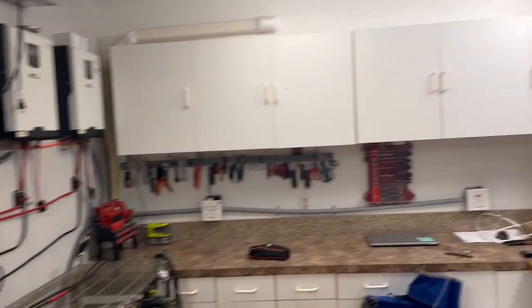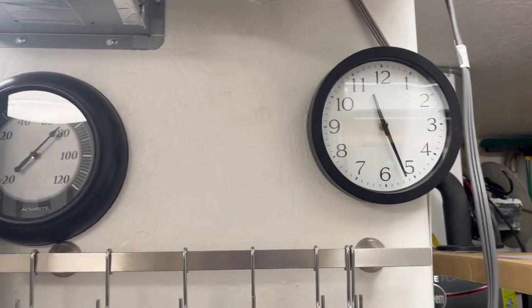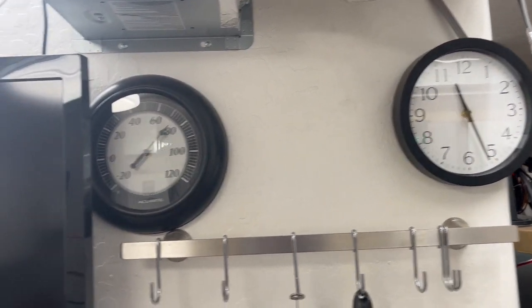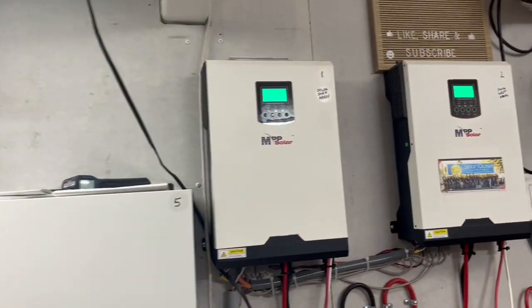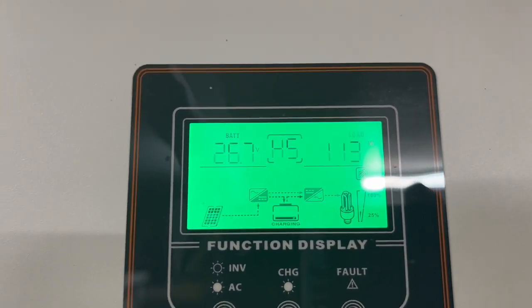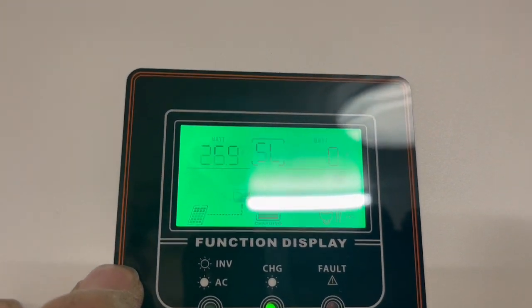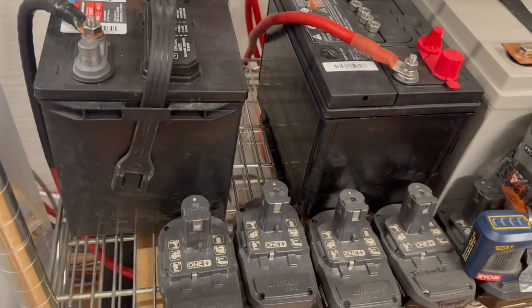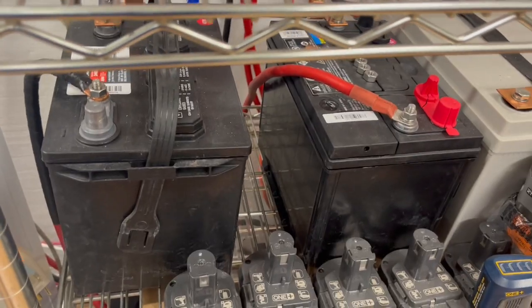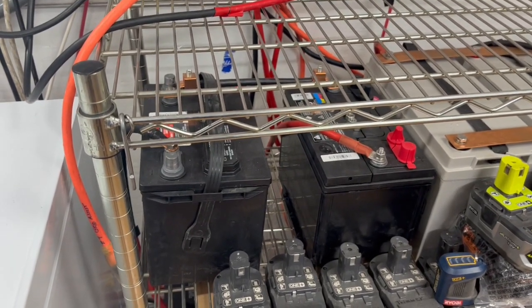Right now it's 11:30 in the morning and it's 95 degrees out. We live in Phoenix, where your garage is usually the outside temperature. We're at about 74 degrees in here — nice and cool. We've got our 24-volt inverters over here staying charged, pulling in 7 amps, at 26.9 and 26.7 volts. We're fully charged on this. These are just Walmart deep-cycle 12-volt batteries — two there, two down there. Those have lasted me over two years, because I don't drain those below 12 volts.